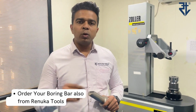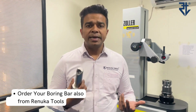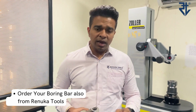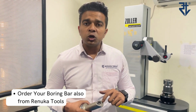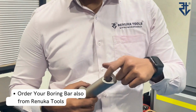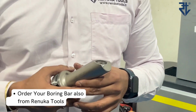Okay, so there is one thing that I definitely wanted to highlight in this video: a lot of customers buy micro bore units from us and get the boring bar manufactured by somebody else. Now that can be for whatever their reasons are, but let me tell you that a micro bore unit will only give the desired level of performance if the pocket of that boring bar is also precise in terms of the mounting screws, in terms of the clearance that is provided in the ID. It's also in terms of the clearance that is provided towards the depth of the unit, so towards the bottom face of the pocket. Plus there needs to be an air hole that has to be provided along with the boring bar, and all of this requires a lot of expertise.